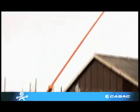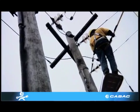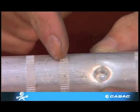These connectors for overhead lines all have central cable location dimples and are filled with jointing compound and have sealing caps on each end. All these fittings have a distinct crimping order and are clearly marked on the connector.